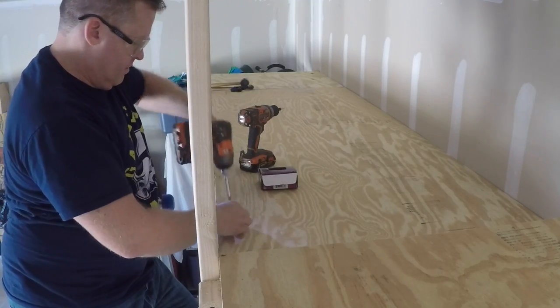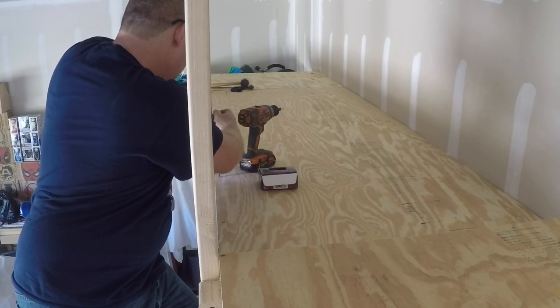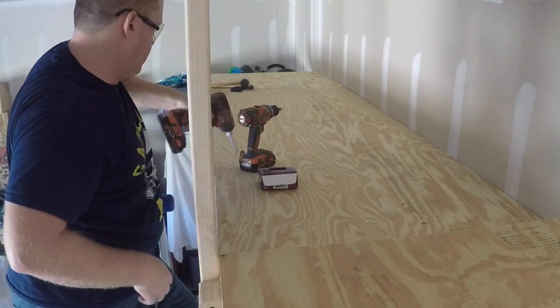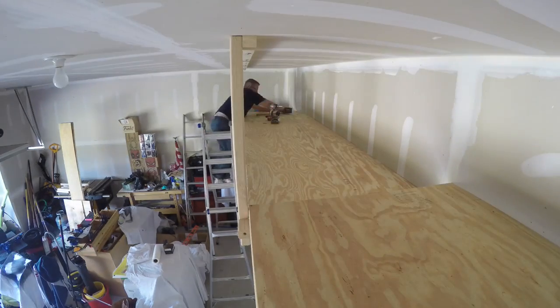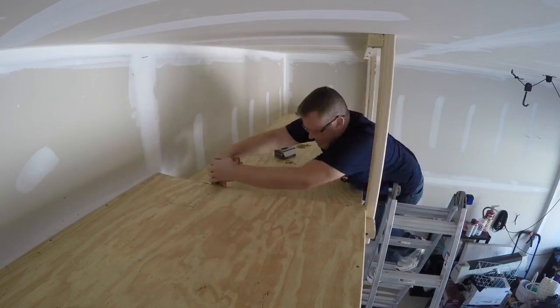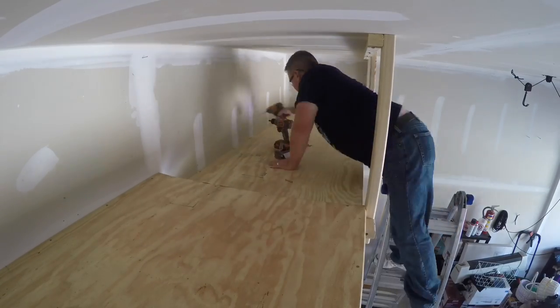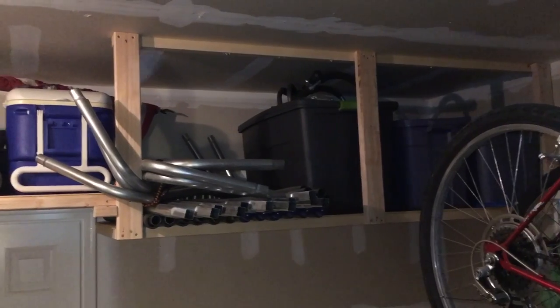Now all that is left is secure our shelf to the ledger boards. We're going to pre-drill and countersink all the holes and secure them with wood screws. There we go, our shelves are complete. A couple of days' work, a little patience and some time, and we increased our storage capacity in our garage,